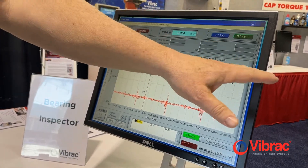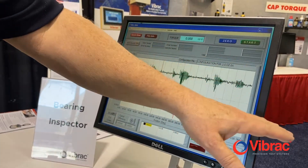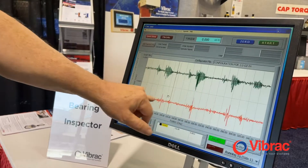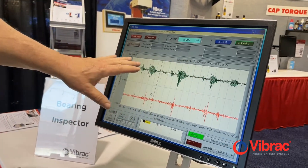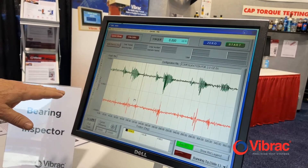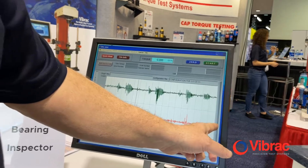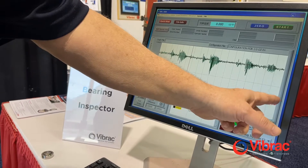The same thing occurs on the next curve, which is in the counterclockwise direction. In the counterclockwise direction, it is graphed in reverse with 20 degrees of pre-test run, 360 degrees of test run, and 20 degrees of post-test run — a total of 400 degrees clockwise and 400 degrees counterclockwise. With the 20 degrees removed, we have readings for 360 degrees starting from zero in each direction.